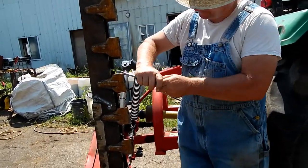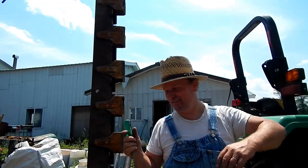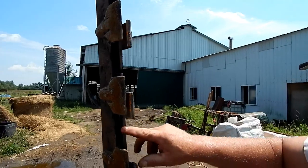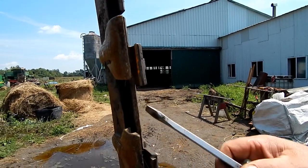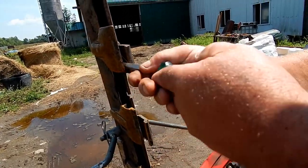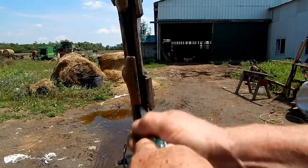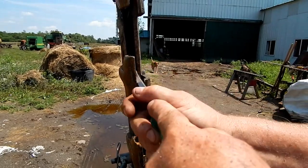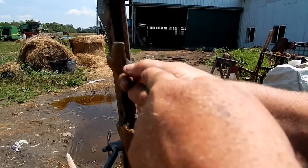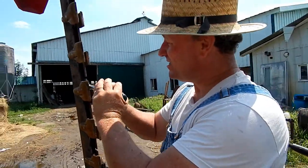So we're back from the airplane. We've got the blades out of this cutter bar right now. There's a slot back here that the bar runs in — the guard bar actually — and it gets grass behind it, mixed with the oil I put on it, and you can see it gets this stuff in there. So every so often I pull both bars out to sharpen the cutter bar, change it, pull the guard bar and check it all out, then clean it. You want to be careful because it's a finger-getter sometimes.